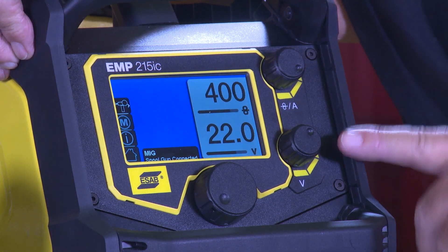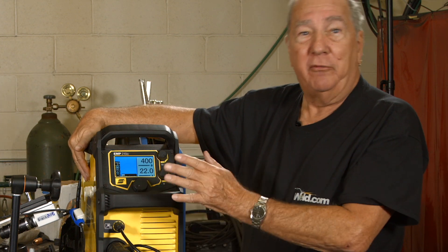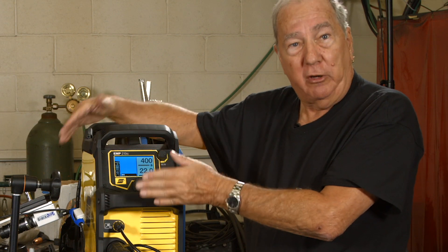Now I'm pretty much all set. You see a display of wire feed speed and voltage — this isn't set automatically for you. Inside the cover there's a whole series of procedures for different thicknesses, wire feed speeds and voltages, different materials, different gases, different wire sizes. All I did was look in there, get the procedure for the thickness I'm running, and kind of tweaked it myself. You're not locked into these of course — if you like a little harsher or softer arc, you can always go up and down a little bit on the wire feed speed or the voltage to get the arc you like.